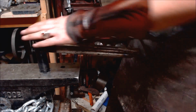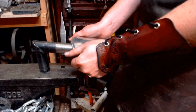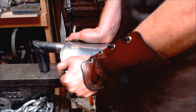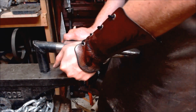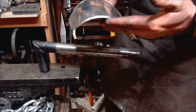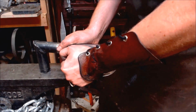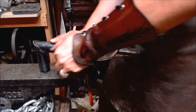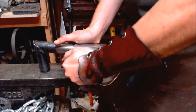Okay. Find a bar or something you can lean on that has a nice broad circle. Starting from the rim at a slight angle, you're going to begin bending the piece over several small folds. Your first fold should be even more than that. The slower you do this, the more even toned and even looking your piece will be. You're slowly working the metal. Here we go.